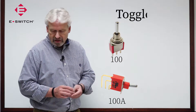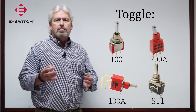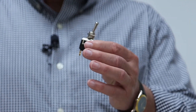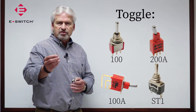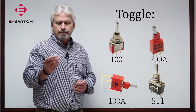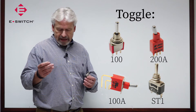The next product category I'd like to discuss are toggle switches. Toggle switches are widely used, typically used to switch functions or to power on and off your equipment. A toggle switch could be a large power rated switch like this, rated to 20 amps, that carries agency approval. It could be a much smaller switch such as this one, rated to 3 amps at 125 VAC. Popular products available as either panel mount or PCB mount in a vertical and right angle configuration.